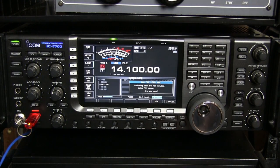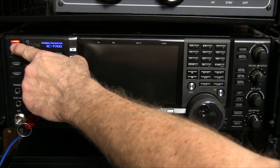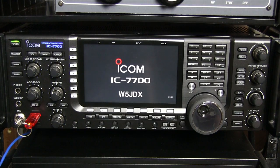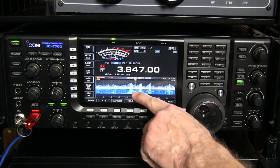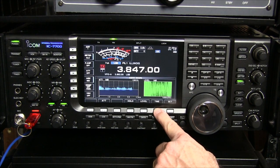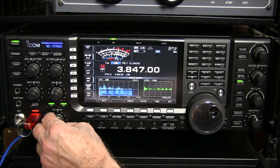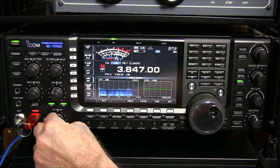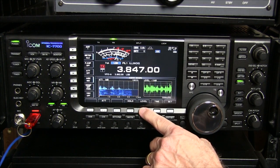We don't do anything with the rig — especially don't turn off the power. Once the file is loaded, it presents another dialog box that says please wait until this dialog disappears, and then reboot the 7700. Eventually I get another screen that says the update is complete, and now I should power off the rig, power it back on, and don't do anything until the normal operation screen appears. These things have taken a little longer than you're seeing on the video — I've edited it down to get right to the point. The rig is rebooting now, and it looks like we're back.